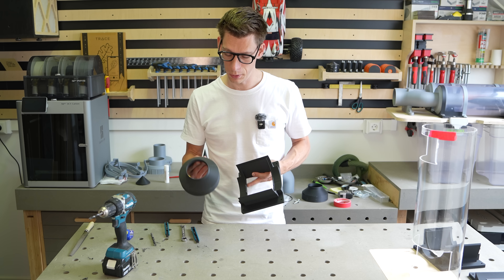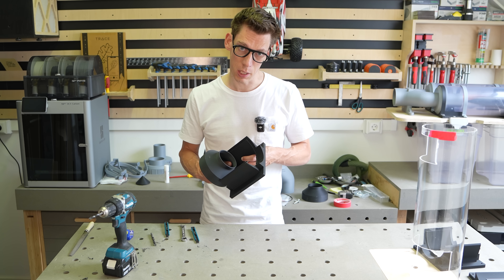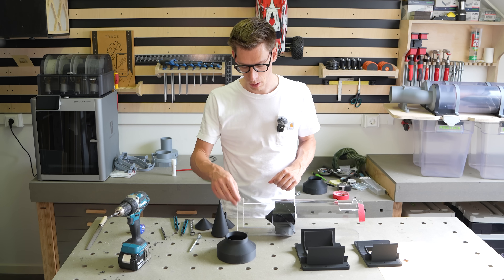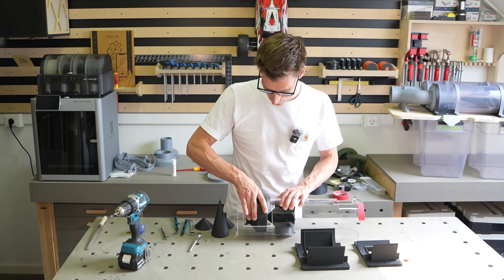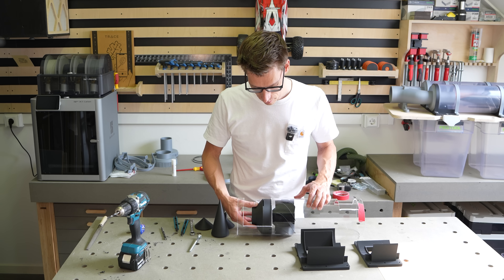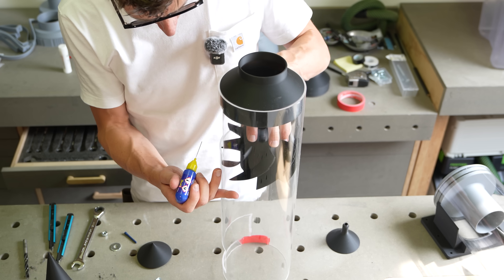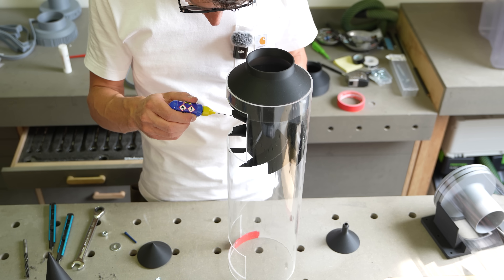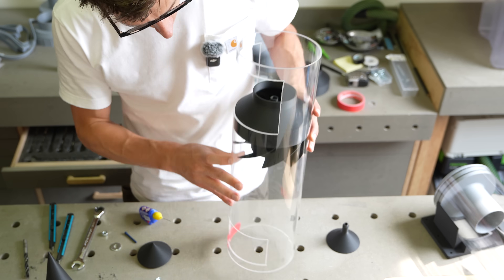After reprinting the front dustport and the shroud with the groove that has more play, assembly and disassembly is much easier now. This time I don't preassemble all the parts first because the shroud fits through the cutout of the dustport. It has a small chamfer on it so you can slide it back more easily. You need to pre-glue all the spots on the impeller without putting glue on the tube. In this design the O-ring is missing from the shroud to find out if you can do without — it makes the assembly easier.